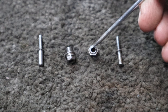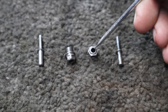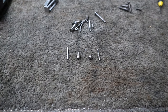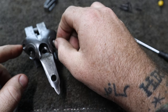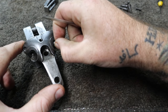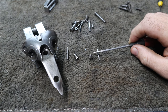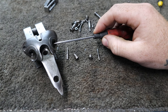You can kind of tell at the end here that that part has been cut and it has not been cut straight — that would be the bottom of the grease nipple. These also are different size hexes. This original nipple fits in here, but if we try to put this original nipple into the right side where this grease nipple came out of, you'll see that it slips straight in. So the threads are buggered up, because they have torqued in essentially a fastener that is too big for the threaded hole — 0.235 versus 0.250, so 15 thou bigger. The thread pitch is the same but the thread depth is not.